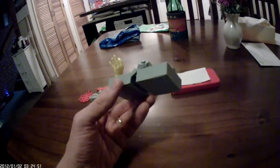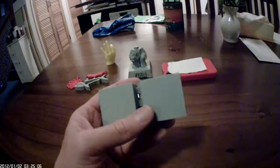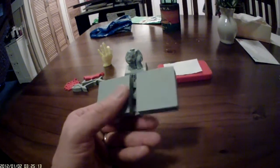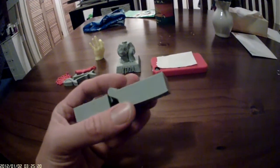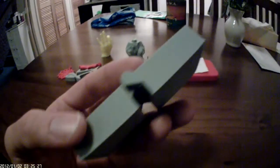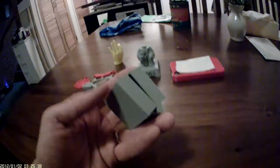From Filament Friday I'd seen this one-print box, and that's printed out in ABS at a 0.1 layer resolution. This time I didn't use a raft — I just used hairspray. Never used it before, just had some in the cupboard, gave it a shot and it worked a treat. Printed the first layer at 0.3 and then the rest at 0.1. You can see the slightest bit of curling on the edges but the rest is all flat. There's no splitting in it, and I just gave it a bit of a twist and it popped right off. I just put my thumb in there and it works beautifully.